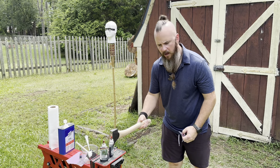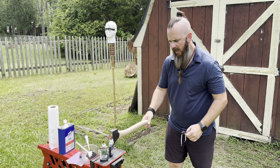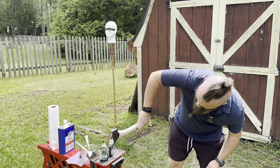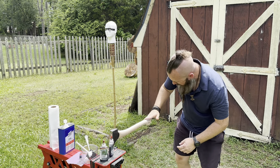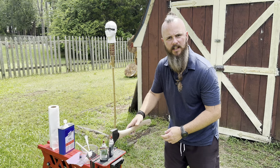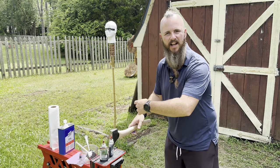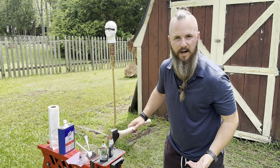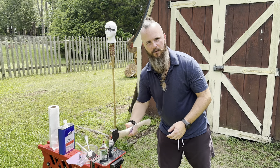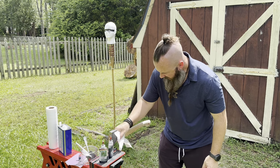I like the right side smooth and right in here smooth, but I do like the left side a little rough to give my fingers something to grab onto. We're just going to knock this down real quick. Don't sand too deep — if you sand too deep, you'll go past what you've raised, and when you go to put the denatured alcohol and dye back on, it's going to raise the grain again. Just lightly knock off the raised grain.